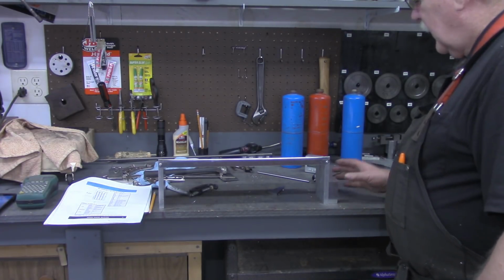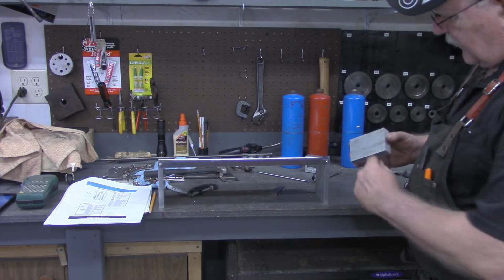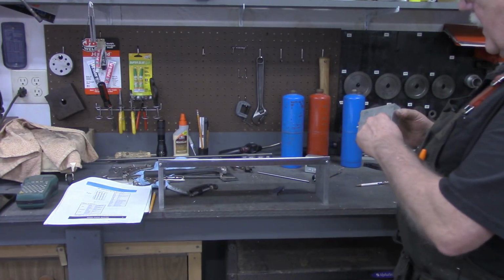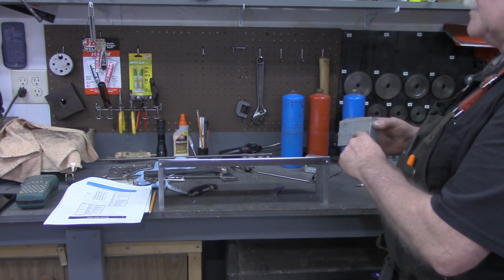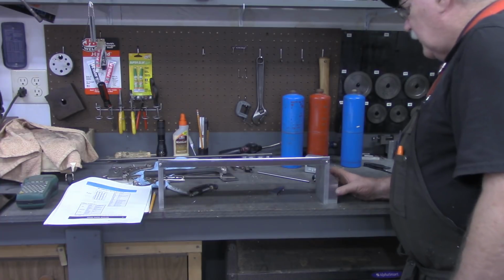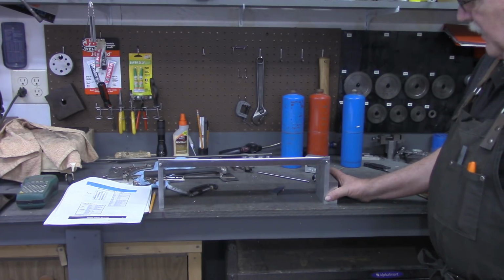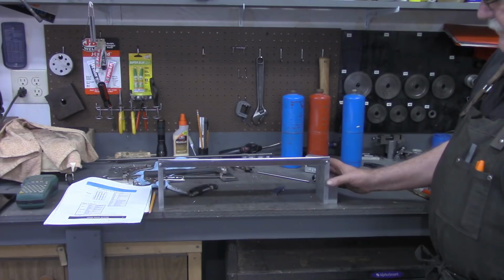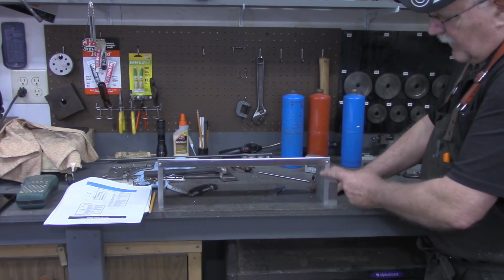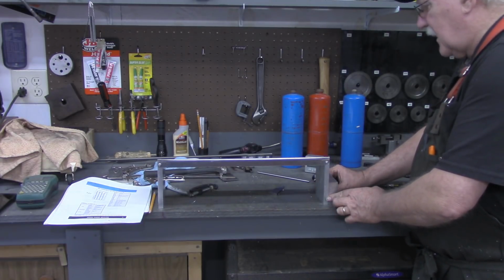What I'm going to do is mill a pocket out of this end down here. The pocket will not go all the way through. The remote is 3 1/4 inches deep, so I'll go half that, or a little over half that distance in depth, and enough for the width. And when I milled this piece off, when I squared up the ends, I intentionally made it 100 thousandths under, 3.9 inches versus the 4. The reason I did that was, of course, the factory edges on these risers that we've got here are rounded a little bit. So I want this inside that round.